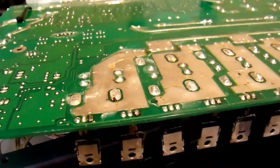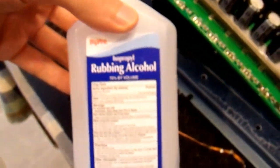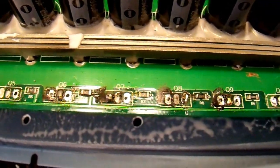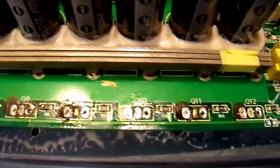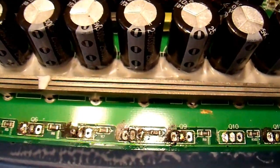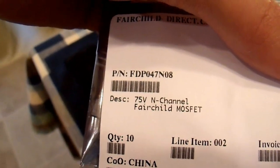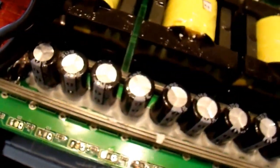The circuit board is fine on this side — it's only the underside that has a problem. I cleaned the circuit board, removed all the transistors, removed some solder from the holes, and used isopropyl alcohol to clean it up. It cleaned up pretty well with very little damage to the printed circuit board — it won't be a problem to repair. The question now is which transistors to put in. I have some Fairchild FDP047N08s here, but those aren't really the right transistor.